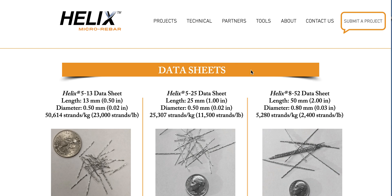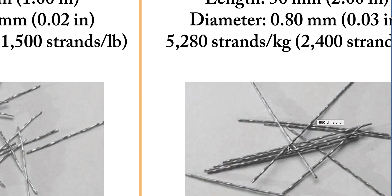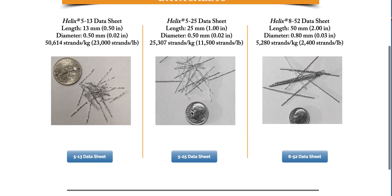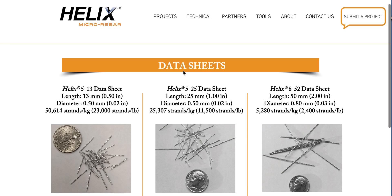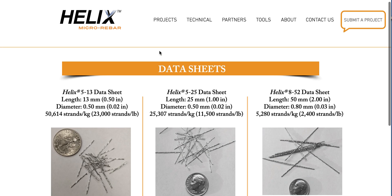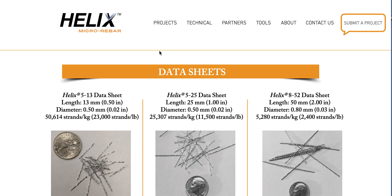Just wanted to give you a heads up on where we're going with this Helix product. There are also other fiber products besides Helix that are not helixed — just straight metal fibers. This product is also approved or can be approved in various locations around the country. What's very critical for me is the unsupported spans this can take, because ultimately water gets underneath a concrete pad, causes soil expansion and contraction, creating voids — and that's where we get our breaks.